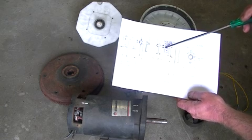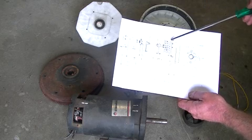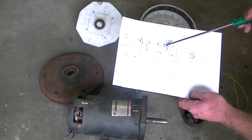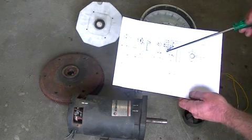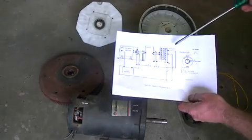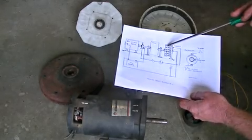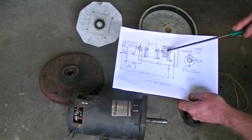If you alternate your magnets you don't get that happening, so I do believe they now use an alternating pattern for their magnets on their flywheels. We will be doing the same — six magnets and six coils — and looking at the picture they seem to be hooked in series.